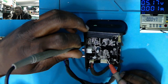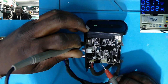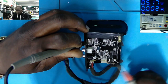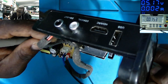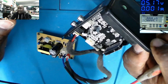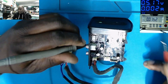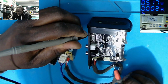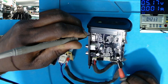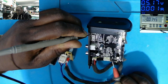In order to have a display, we must have 5 volts — that's probably the standby voltage which is always on. We have a 7805, a linear regulator with an output of 5 volts. Let's check this linear regulator. Pin number one is the input, this is the output, and this is the ground.